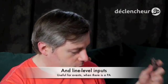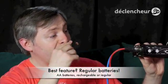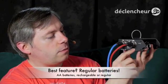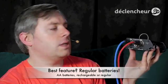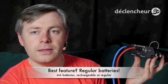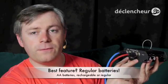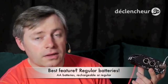So what you want to do next is plug in your microphones. It takes dynamic or condenser microphones on XLR inputs. You can use wireless microphones — it's a very flexible set of inputs. You switch them from MIC, which is dynamic, to 48 volts for a condenser microphone, and also line input. Like if you're shooting an event and there is a PA and you want to take a feed from the PA, then you switch it to line input — extra flexibility.